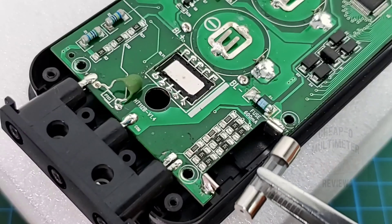You don't often see this type of embedded NCV that performs so well, but in this case it did really, really well. On the other side, at the top we have the LED for the flashlight. Take a look at the gauge of the PCB — nice and thick. According to the digital caliper, the thickness is just over one millimeter. Nice and thick — beauty.